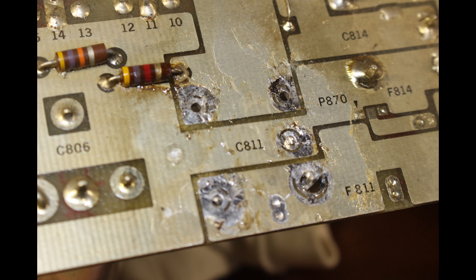That foil runs farther, but it's intact as far as I can see, and that's the side I'll be soldering on. Pulling the three lugs that I cut off should be a lot easier — I can get into both sides of the board, and I don't have a huge aluminum can wicking all my heat away. The repair is also going to be ugly, because once I got done with those two lugs, I tried to clean some excess flux with isopropyl alcohol and discovered that the board is lacquered, and the IPA stripped the lacquer. But the lacquer seems to be another bit of military overdesign — there's no corresponding protection for all the push-on connectors, so I'm still not too worried.